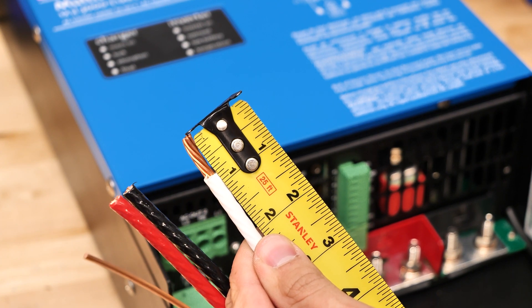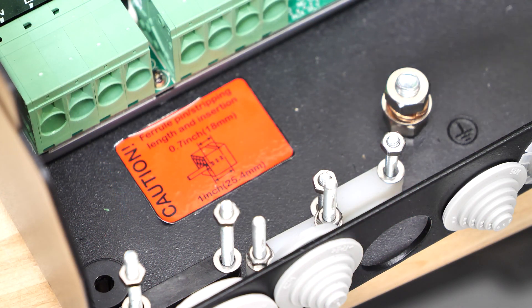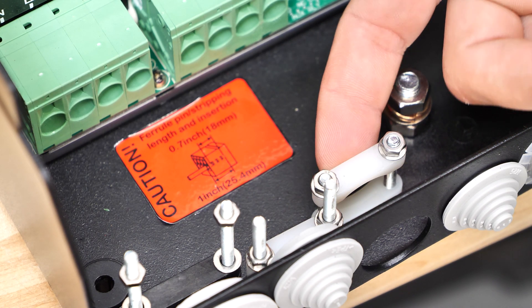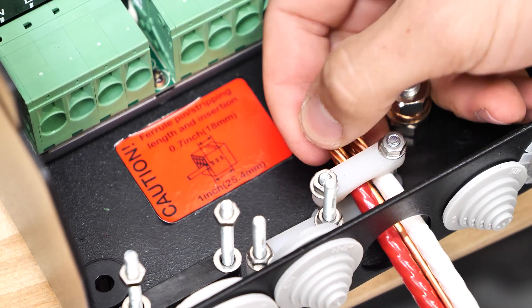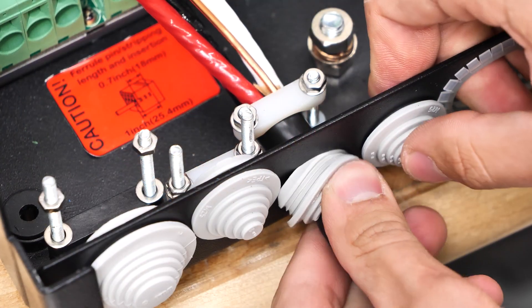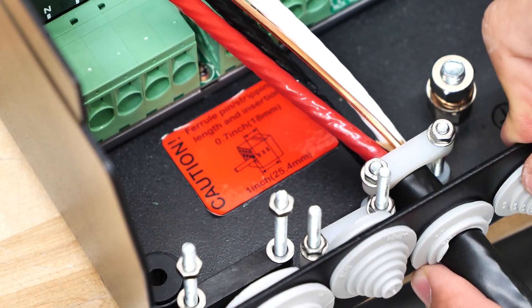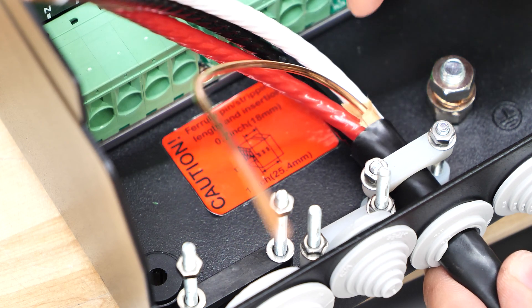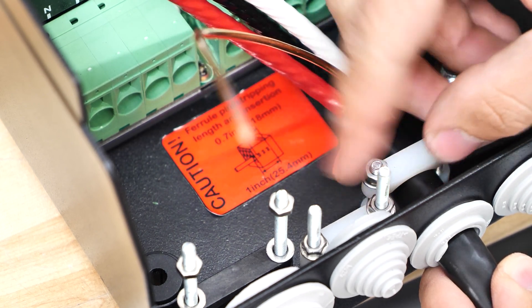You can see that is approximately 3/4 of an inch — that's what we want to strip on all three of these insulated wires. Inside of this inverter, there are these nylon clamps. I've already backed off the screws here, but you want to be very certain that you take advantage of these so that you don't run the risk of the wires being pulled out in any way. The wires would feed in through there and then I like to bend them up. Once the wires are in, we can shove this grommet back into the hole. The most important thing to note is that the insulation is what's under the clamp — not the actual wires. So I have it installed about a half inch past those clamps, and from here we can get the clamp snugged down at least finger tight.